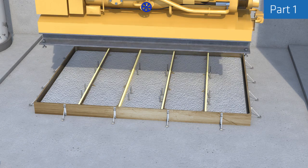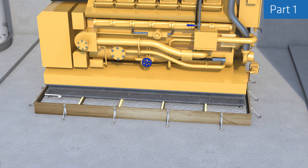The machinery is then put in place and leveled to its final position. Protect any adjacent steel surfaces with tape and use plastic sheeting to protect the equipment as necessary and prevent adhesion of the epoxy grout.